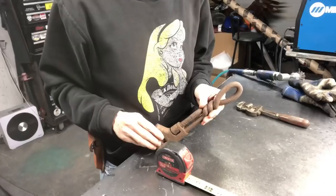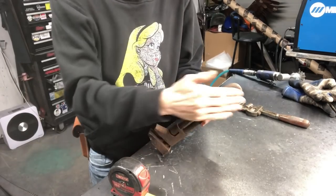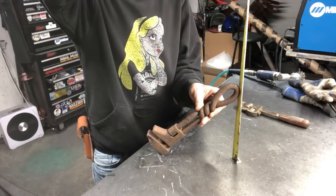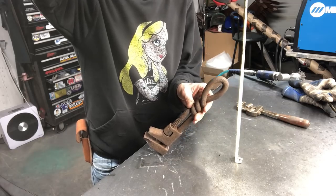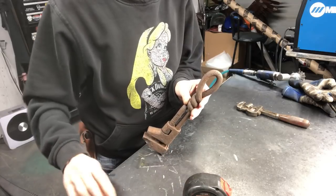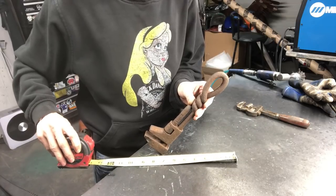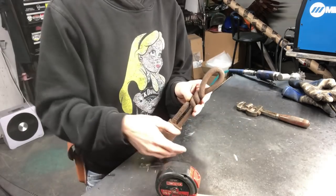So let's get started. In order to get the measurement for my base, I'm going to hold my largest piece at about a 45-degree angle, and I'm going to take my tape measure and measure up to the tallest spot. I'm getting seven inches here, and I need to mark the spot on my bench where I want to hold it from. Holding it still, you want to mark from that mark out. I'm looking at about seven inches tall and seven inches long that I need to cut those two pieces at.